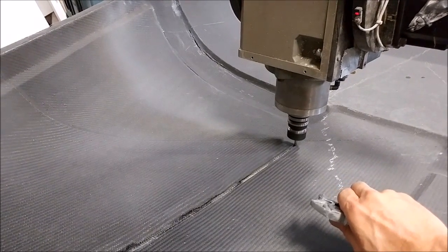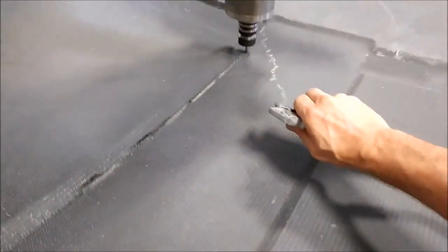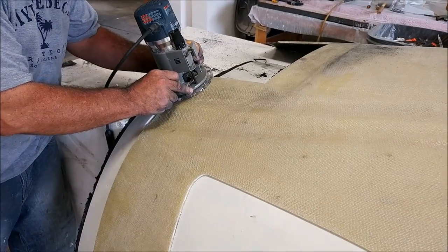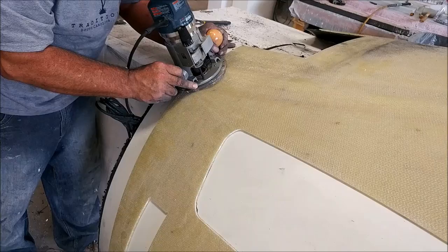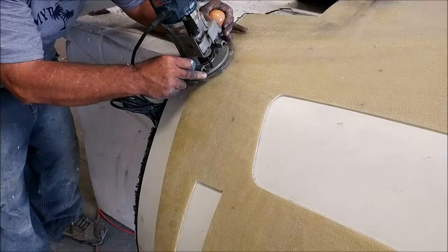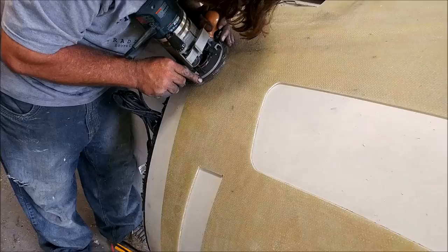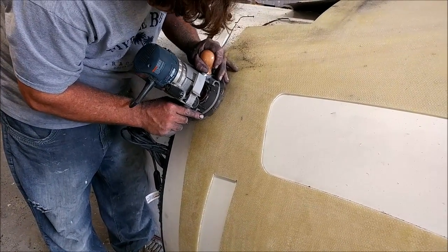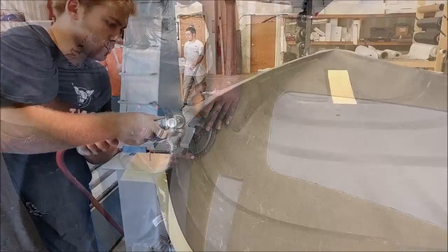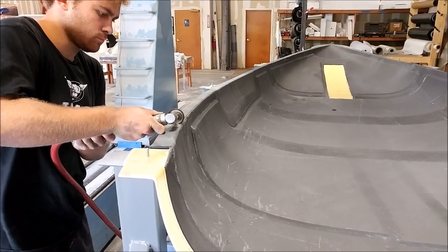Here's Jeff using the router along with the routing mask that we created a few weeks ago. We've laid that over the top of the upper fuselage part and he's running the router along the edges of it, cutting out the parts that we don't need. Right now he's working the back edge, and the window will be next. Here's Keith doing a little bit of hand trimming on the flanges on the lower fuselage.